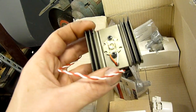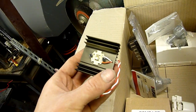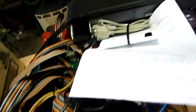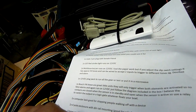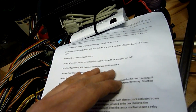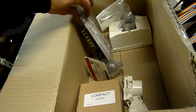Super bright LED on a heat sink from an exit sign or something. I'm guessing it's a bright green LED. I'll have to put power to that — I don't know what voltage it would be. Red LED strobe light at 12 volts. LED with heat sink, unsure on voltage — it came out of an exit light so I'd start with 5 volts and see what it does.